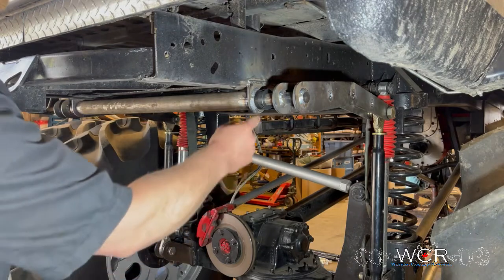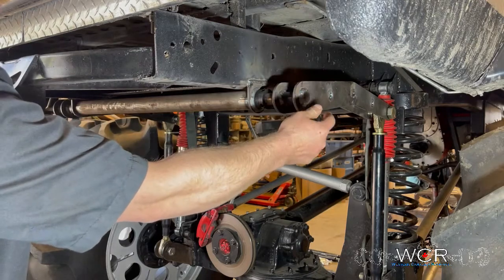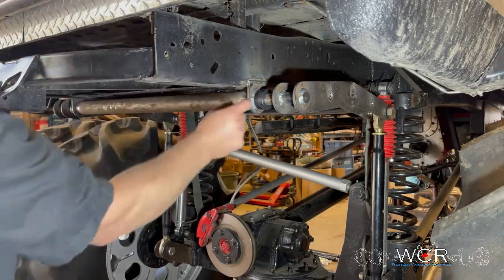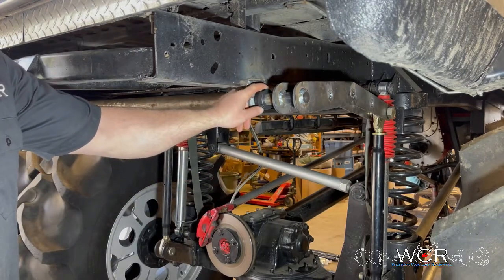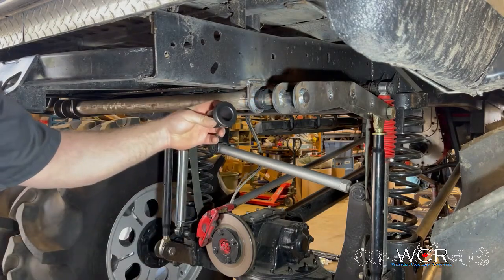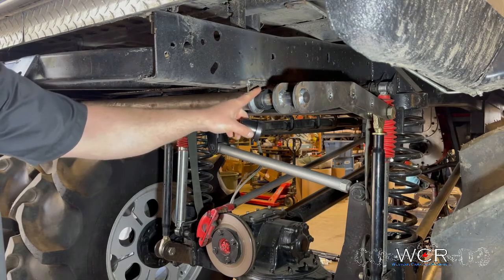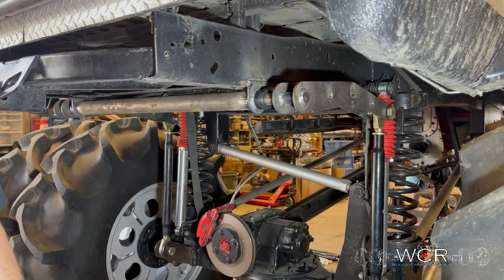One thing to keep in mind when welding the arms: slide the bar out quite a ways, weld them, let it cool, then slide it in to the desired length. When welding the second arm it will be close to the bushing — usually we space it out about an inch and wrap the bushing with a wet rag. That just helps prevent heat buildup. These will take a fair bit of heat but only to a point, so if you get the bar smoking red hot it will damage the bushing. Just keep a wet rag over it and it'll make sure it doesn't get damaged.